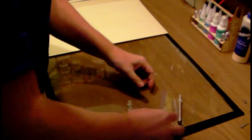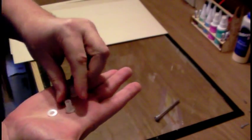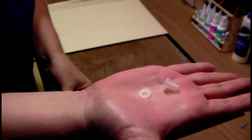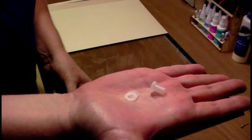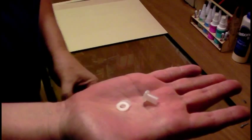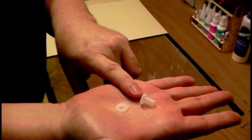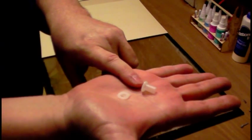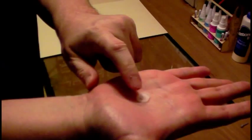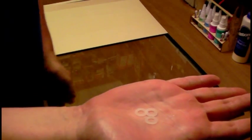You're going to need a couple of nylon parts from your Ace True Value hardware. First, a little nylon shoulder bushing — inside diameter roughly a quarter inch, outside diameter about five-sixteenths of an inch, about 30 cents apiece. This serves as our bearing on the yaw pivot control, and it's so much simpler than trying to nest a bearing in the yaw plate. Get two of those. Then get some quarter-inch inside diameter nylon washers — you'll want three of those, about 20 cents apiece.